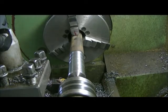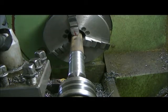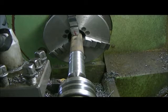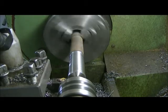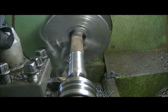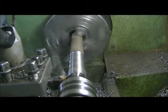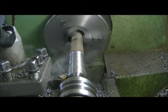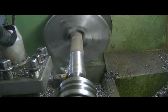Keeping in mind, you know, when you take 10 on your gauge, you're actually taking 20 thou off the shaft. It cuts all the way around. So it's taking twice as much as what you really think it is. Cutters last 3-4 times as long. I used to use cooling liquid all the time, but it gets stinky and I don't use the lathe enough anymore, so I just put a little bit of, actually that's just threading oil, so anything like that'll help.